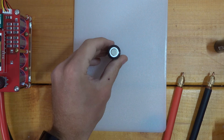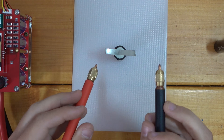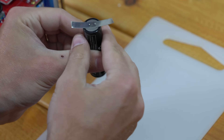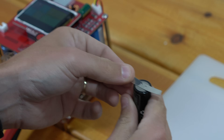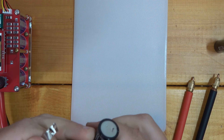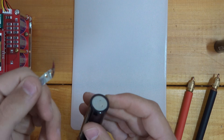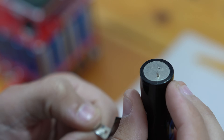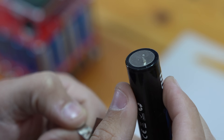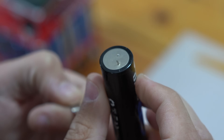Let's try this now on a cell. Let's go on the negative end of the cell — less danger there. One spot weld coming up. Looks good, nice and clean. Let me see if I can pull that off with just my hands. I was able to get it off, but we definitely tore nickel out of the strip. This is 0.15 millimeter nickel strip, so that's exactly what you want to see with a nice weld — getting that nickel strip just ripped right off, really part of the stainless steel can of the cell there. So that's a good sign.